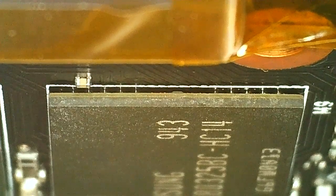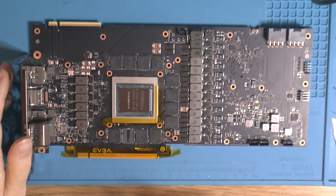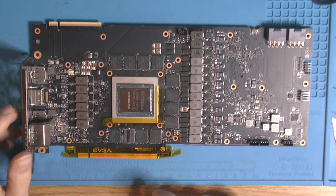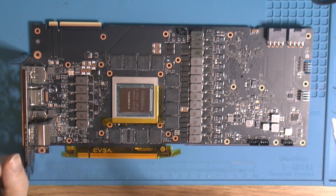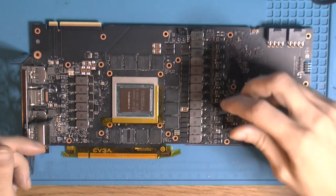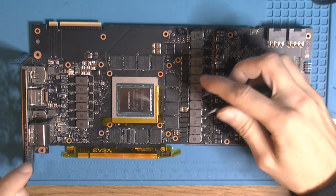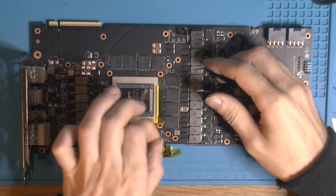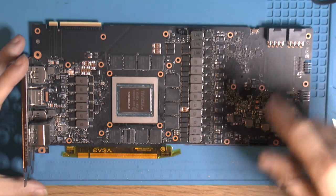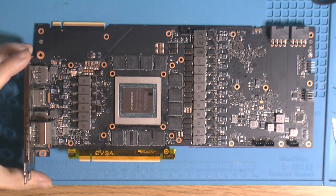So, time to test it with the cooler on. I'm just gonna put only the GPU cooler on because the card isn't drawing that much power. Most of the time when I was testing it, the fans didn't even run because it's winter here and pretty cold. The professional repair people I've seen usually use a smaller heatsink because it's faster. I've seen videos where they don't have any heatsink at all during some phases of testing, but I don't dare do that, so I'm gonna put the stock one on just to work as a heatsink so we can test it. But we don't need any cooling for memory or anything, because it doesn't draw any real power in that test.